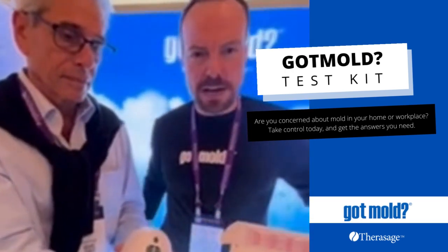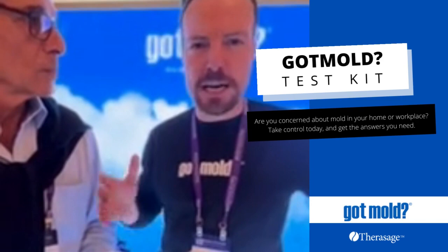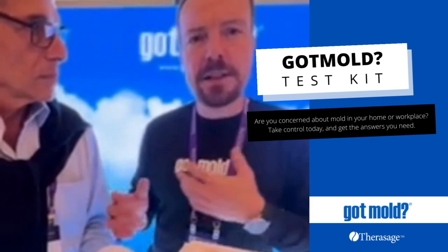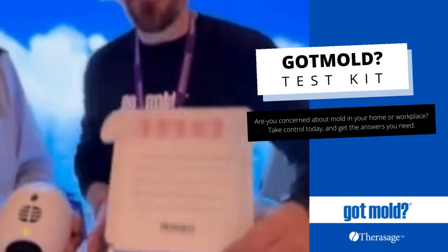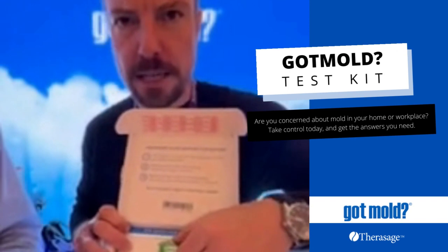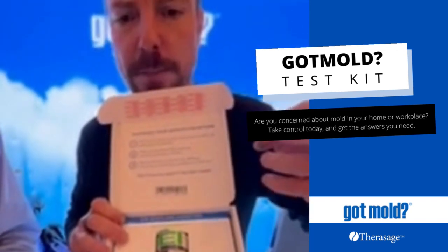If you were to have your house tested for mold currently, and you wanted to have a professional come in and do the testing, they would come in with a whole bunch of tools, right? Moisture meters, infrared potentially, and at the end of the inspection, they would likely recommend air sampling. Generally speaking, what you'll have is the recommendation of air samples using spore traps, which is this technology, right? And it's exactly what it sounds like. These cassettes capture the airborne microscopic spores.